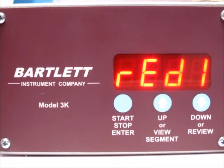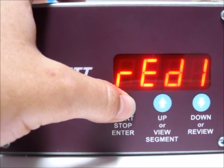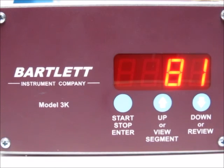Now 'Ready' is displayed. If you do choose to use six to eight segments, it will go through each individual segment and let you change each parameter, but once you've programmed each one, you'll come to Ready. When the kiln is ready and you want to fire, press the stop start button. You should see the temperature displayed solidly — if it's flashing with 'Idle,' the firing has not begun. Now you can tell it's started because it's not alternating.